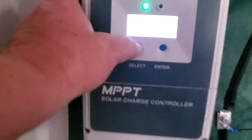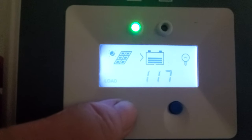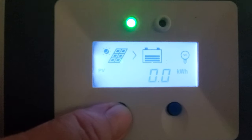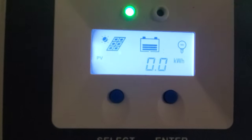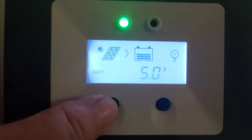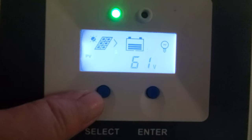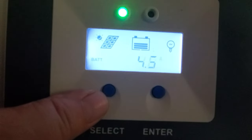Let's see what this shows now — see if we can read it. Zero amps now, that's a load. My PV: 59 volts, 2.2 amps. I don't know why it's not showing kilowatts — something I've got to set up probably. But my battery is at 25.3 volts. The temperature's there. So it was at 25.1 when I turned it on, so it's working. 61 volts, 1.9 amps — I've got to figure out why it's not showing me the watts.